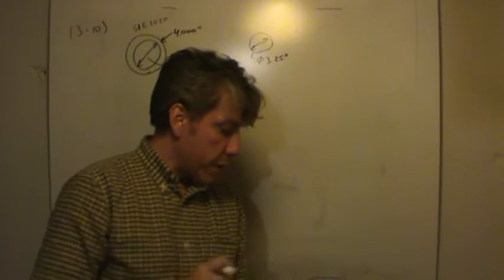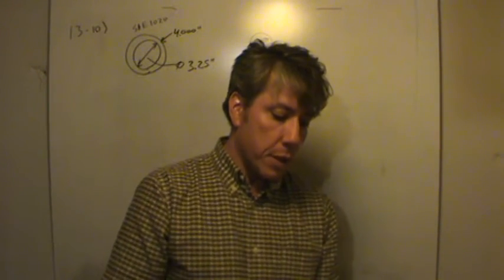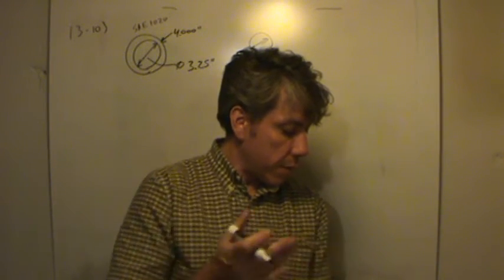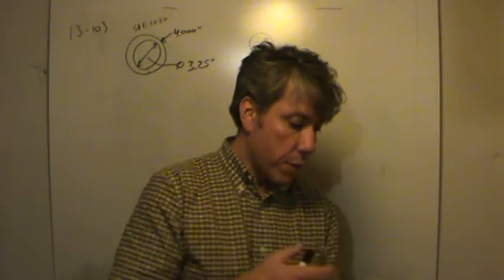Alright, so we have to select a force fit, and they've asked us for a heavy force fit. So let's go back and look for a specification that will give us a heavy force fit. Go to page 495 and look at table 13.4. So here's force and shrink fits. They've got an FN1 all the way through an FN5. But which one is considered to be a heavy force fit? Well, let's find out. Go to the next page, page 496. They've got FN1 light drive fit all the way to FN5 force fit. Now, the way it's described, FN3 in the center is described as a heavy drive fit. FN4 force fit is used for high strength assemblies where higher resulting pressures are required. FN5 is similar to FN4 for higher pressures. Now, I don't know exactly what they mean by a heavy force fit. I assumed that they meant FN5. So that's what I'm going to design as an FN5.